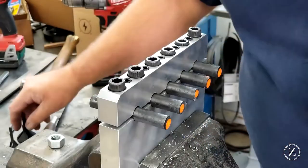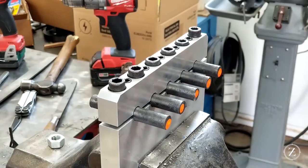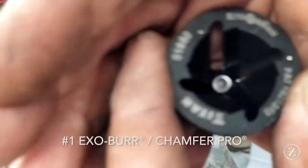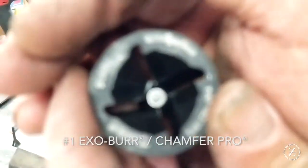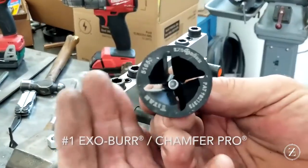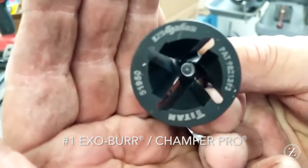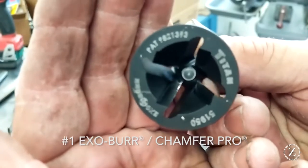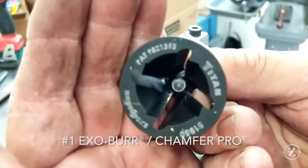We've got some pieces ready to go here — these are 50 to 55 Rockwell, so they're rapidly approaching the hardness of the tool, and we're expecting some failures here. I blew these out with an air hose. Let's take a look at those cutting edges — you can see them as I rotate it to let the light catch it. We've worn away the coating but the cutting edge is still good.